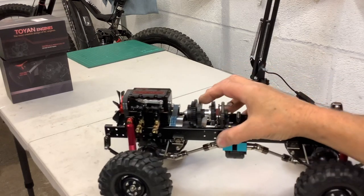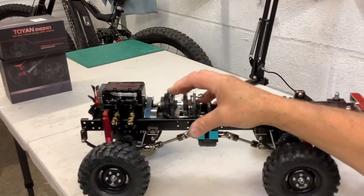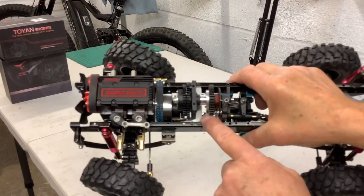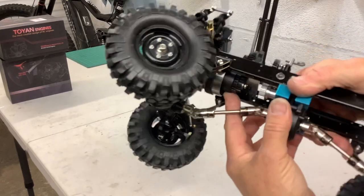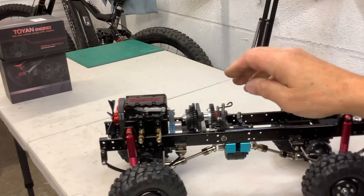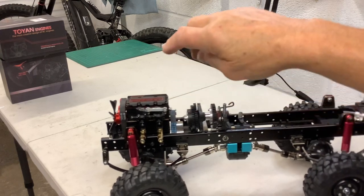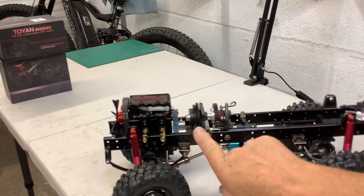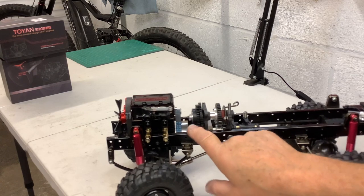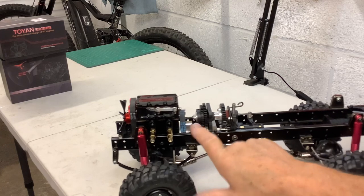This part here is actually off a really early Kyosho RS2000 — I've got a lot of bits and pieces for those. I made it fit onto a little plate and you can space it up and down to get the correct gear mesh. If I change the gears — and I'm not sure this is going to be high enough geared — in my Beetle I've got this setup with that kind of clutch bell on it, the same number of teeth. Bearing in mind that engine revs to 18,000–20,000, it's fairly fast — it'll pull wheelies and it's a really fun car.